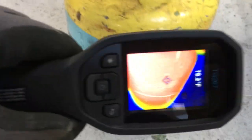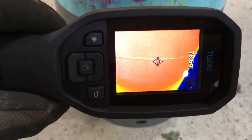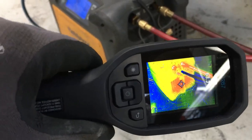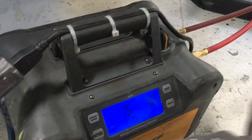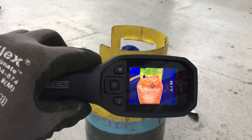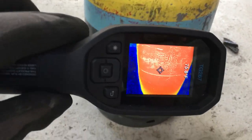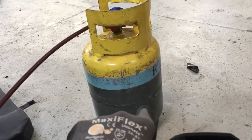Let's see what the tank did. Our tank is now at 75 to 80 degrees, approaching 80. You can see how the pressures have raised — look at the pressure: 86. That's the pressure inside that tank. At the top I'm reading 69 to 70. The blue stripe is around 75. Going to the gray area: 76, 77, 78 — you see how the temperatures change as I hit different colors and they reflect differently. My tank is full.